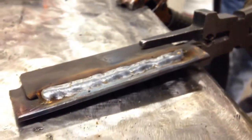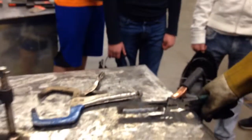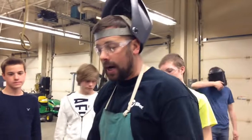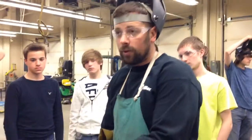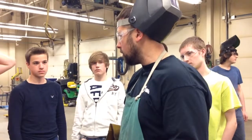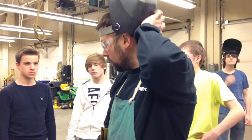And I welded right over the top of my spot welds — I don't want to weld in between them like a field goal, I'm just going to burn right through it. That is lap weld 101. Quench that, bring it over to me, and I'll let you know where you're at for proficiency and grade. If you don't do well, you've got another free shot on the backside. You blow it twice — okay, let's figure out what you didn't do right, get a couple more test pieces and set them up. Questions? And scene.